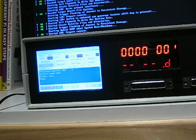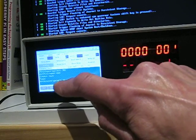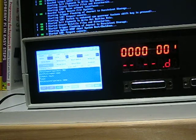It's obviously set up as default to a Z80, and Z80s can use obviously IO lines, so that will work with the Z80. If you set it to an 8080, you probably find that won't work. The target is actually the processor you're using. So if you're using a board that's got a Z80 in it, you really want to set it to Z80. If you're using a board with a 6502, you click it to 6502 and it will tell you it's gone to a 6502 down here. The effect is immediate. As soon as you click that button, it works straight away for that processor.